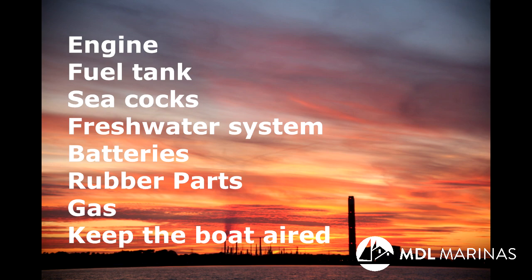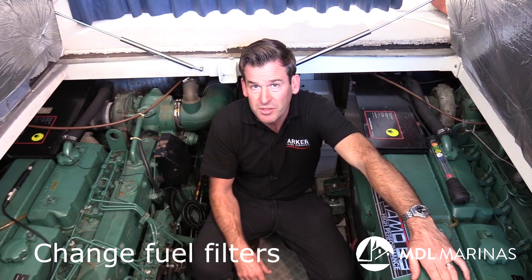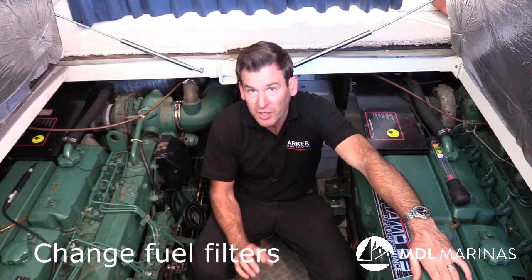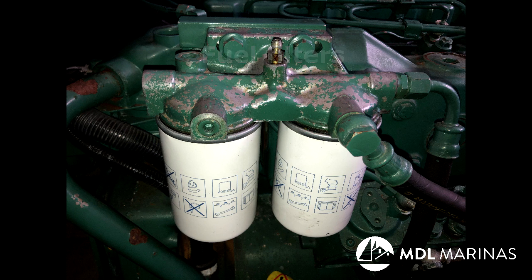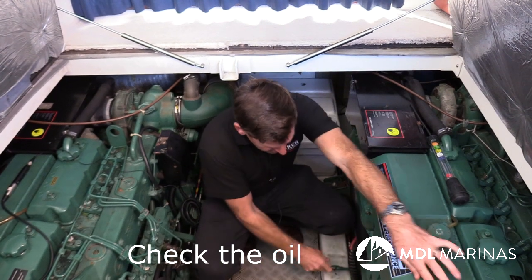From the point of view of the fuel system, it's actually a good idea to change the fuel filters before we winterize. If we're not going to use the boat for a length of time, change the fuel filters, because any dirt or water in the filters can grow bacteria and turn into diesel bug over winter — it can actually grow in the fuel filters themselves. If we change them and have nice clean fuel in there, there's no chance of that happening. The same can be said for the oil system as well.